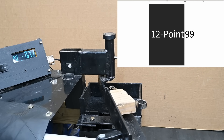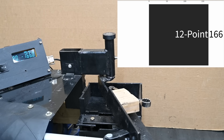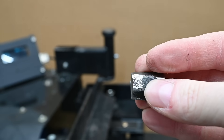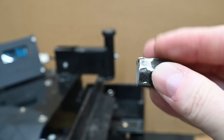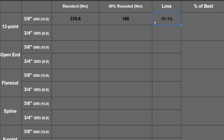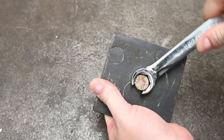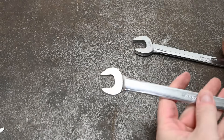On the 40% rounded grade 8 hardware, the 12-point box end gets up to just 166 newton meters — 122 foot-pounds — doing some actual damage and taking material with it. That's 51.1% less than on pristine hardware. I'm assuming that's not great, but we'll have to see against other box end wrenches. And for the first time we're going to compare to open end and flare nut, so let's get into that.